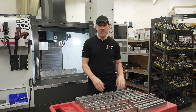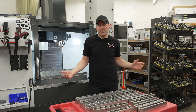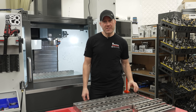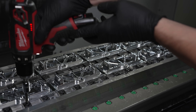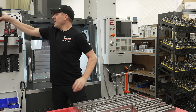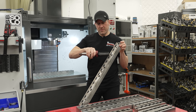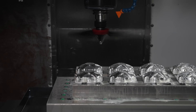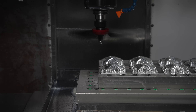They actually last quite a long time. You can go and just helicoil the whole thing, but for me I didn't want to do that unless I really needed to, and it actually works pretty good. Once you have them all loaded up and you're ready to go, I just shut the door, push the button and let it rip - come back three hours later and I have a bunch of chips all over and some complete parts. I also use a chip fan. They do catch coolant and chips, so using a chip fan blows all that stuff out and really helps keep down the blowing time.